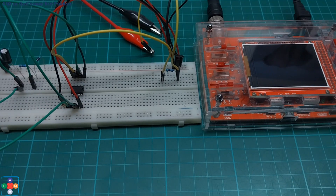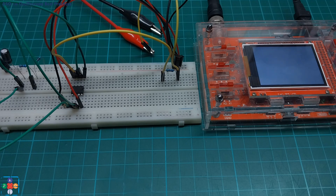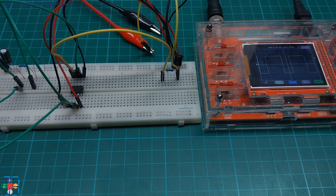Now we can alter our circuit and place the resistor between the 555 IC output and our probe. We can then safely power our circuit and oscilloscope and observe the signal that the 555 IC outputs. At this point you can ask: how did we decide on 1 milliamp as safe? There are several factors that play a role. First: don't be wasteful — this life rule applies even more so in electronics.